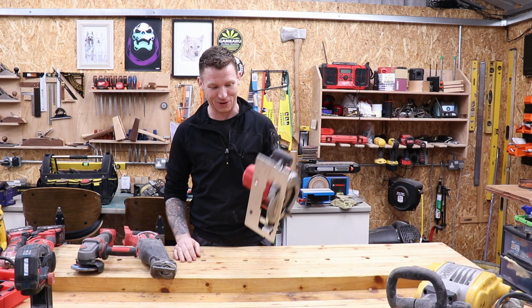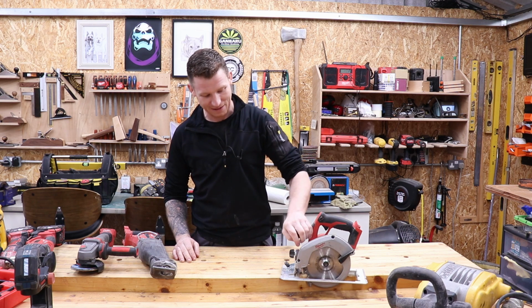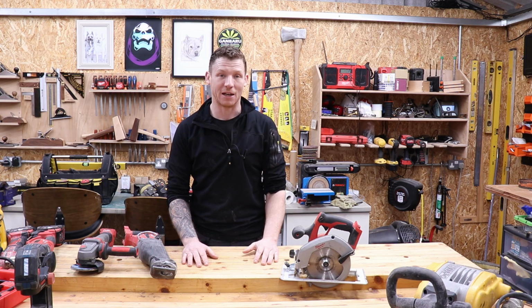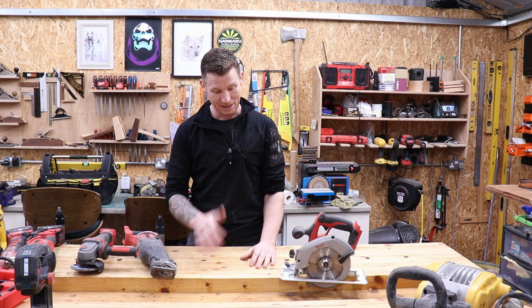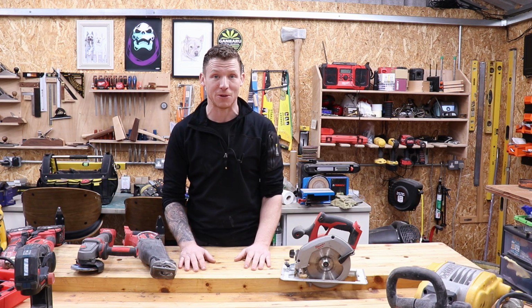And we just have a circular saw again for pulling up floorboards. If you're going to somebody's house and you need to get sockets around the room and they don't want any surface work whatsoever, you usually end up pulling up floorboards, taking up the carpets upstairs, pulling up the floorboards to get cables around, and a circular saw is essential as an electrician. You might not think we'd use them, but we do use them.